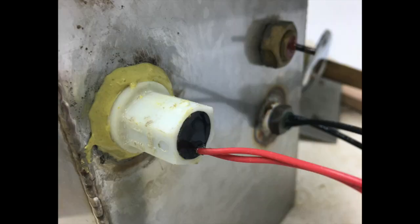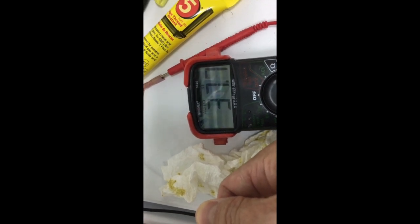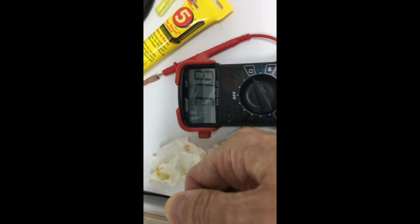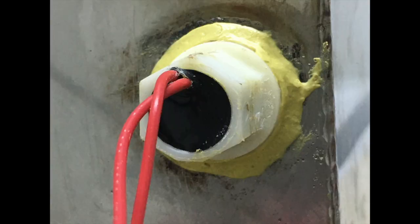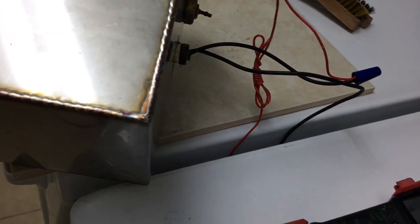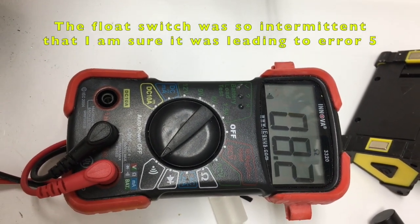Using yellow tube pipe thread sealant number five, I threaded the float switch into the unit. When I tested it, it gave me zero ohms at first and then it goes to 38 — it's erratic, and I think it should be zero ohms, a closed loop. When I put it on the sounding alarm it does work but it's not reading zero. To test the seal I filled up the tank with water and checked for leaks and didn't find any. When I turn the unit over it's reading 8 ohms as opposed to 40 ohms, so we're going to test the unit next.